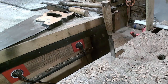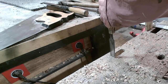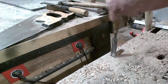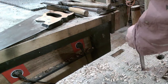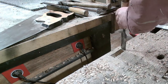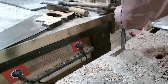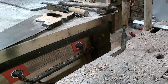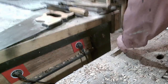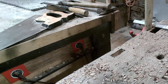Because when you're boat building, you set your waterline. If you've got a fiberglass hull come in, you level it through from bow to stern. And if you don't, you can't use a level for all the other parts of the boat. Remember, boats are not square, are they? They're funny shapes, like boat shapes. Whether it's a spirit level or water level, or whatever type of level you're using, if you set the boat right in the first place, you can work everything off your level.